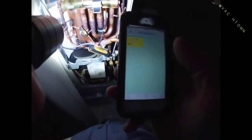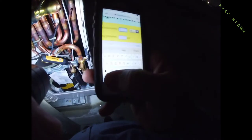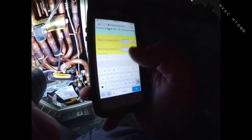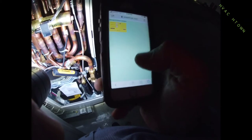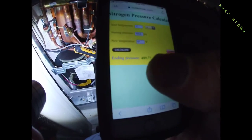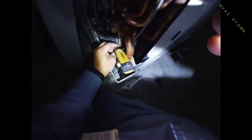Found the calculator I like to use. We'll put the start temperature at 71, starting pressure 493.6, and new temperature 67 — calculate. It comes out to 489.77 as the expected ending pressure. We're actually higher than that, so we're good. It might have been a little cooler yesterday but I can't remember — either way, I'm happy with that. Going ahead and taking this off.